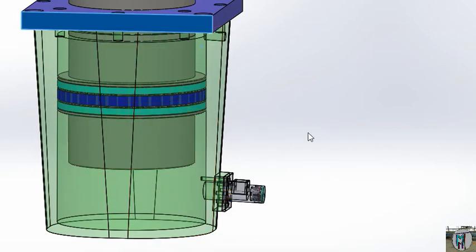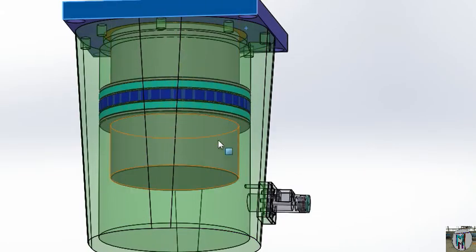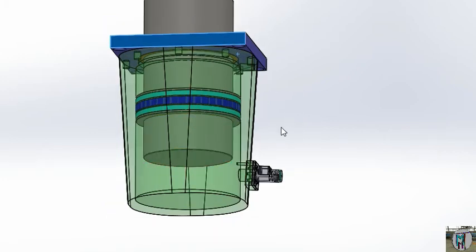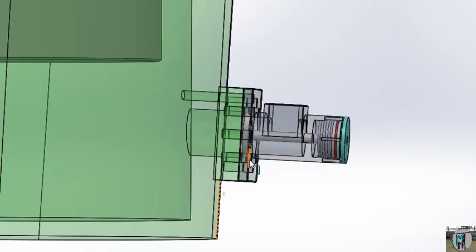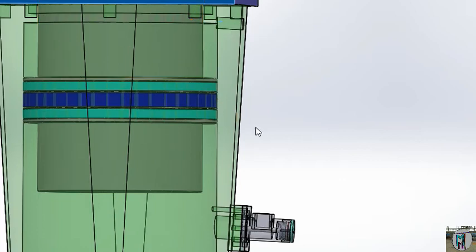In our system, if you are facing some problem of pressure dropping, you have to check the seal first — the seal of your piston. Sometimes your piston — because this is a heavy item, we made it from one pipe — after taking the pipe, we block both sides, so there may be some welding or spot inside. That is the cause of your pressure dropping. The first major part is that your seal is broken. The other is that your NRV is not going in the proper way. And otherwise, your spring is broken so it is not going back. Only three or four processes are there to check your locking valve.